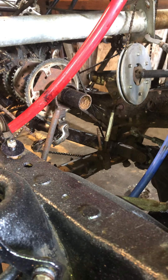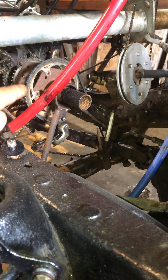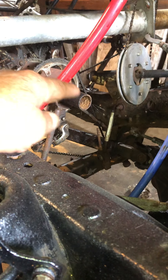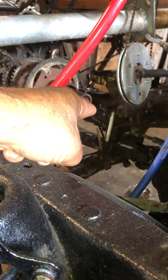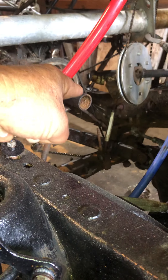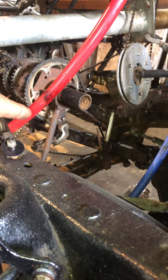Here's another camera angle of the front left pilot's drive line. This is the sprocket that the pilot is paying into, and this side here — the chain going down behind the main jack shaft and then down over an idler — that's the working side. When the pedaler is pedaling, that's the side that's tight, and this is the return side.